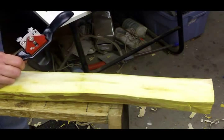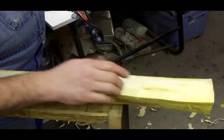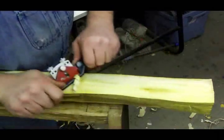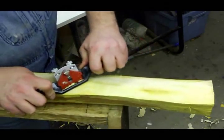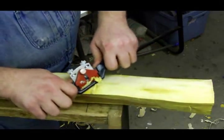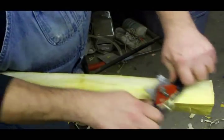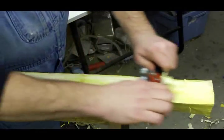Basically we've got white wood with some yellow showing through, and I've got draw knife marks in here where I was really chunking it off. So I need to get those evened out first, get those cleaned up. When you hit a spot where it wants to jump over, take your spokeshave and turn it sideways and work it off towards the edge. If you just keep hitting those washboards, your blade is just going to keep jumping over and making them worse — just like ruts in a road, the more you run over them the worse they get. So I'll get those little areas worked off and we can start going the whole length.